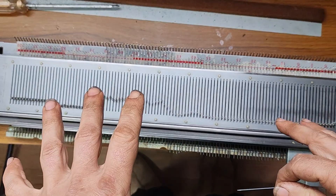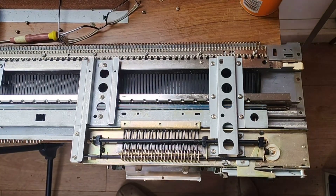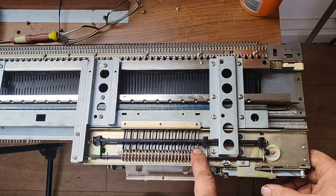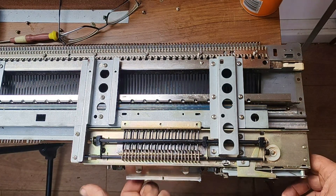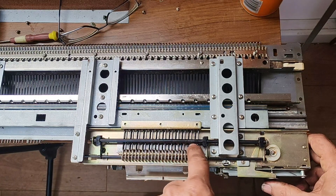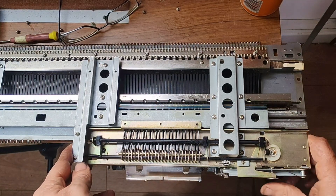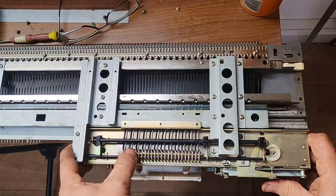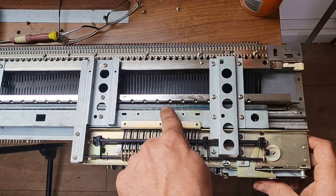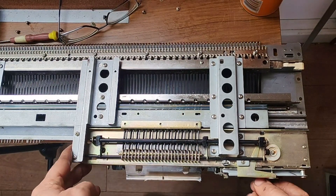In order to show you the magic that the carriage does, I'm going to have to put this machine back together again, so I'll come back in a bit. I'm about halfway through the reinstallation process, but this gives us a nice view. These little U-shaped pieces of wire are the feelers that go up into the punch card — we're looking at the bottom of the punch card reader now. These black rods are the ones that jiggle the strips. Because there's no punch card in there, it'll select all of them. Can you see every single one of these is being jiggled, and every single one is moving backwards and forwards in turn to grab the needles?